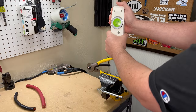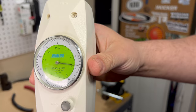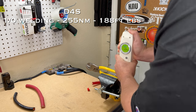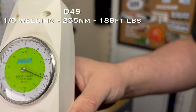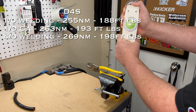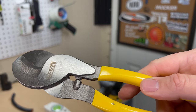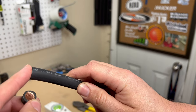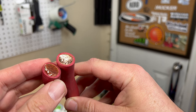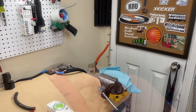The Down For Sound cable cutters on 1-aught welding cable came in right at 255 newton meters. On 1-aught car audio cable it did 263 newton meters. On 4-aught welding cable it made it through at 269 newton meters. Cut quality was pretty good — no strands left on the 1-aught cables, and even on the 4-aught welding cable it left a clean cut, just a little bunched up.